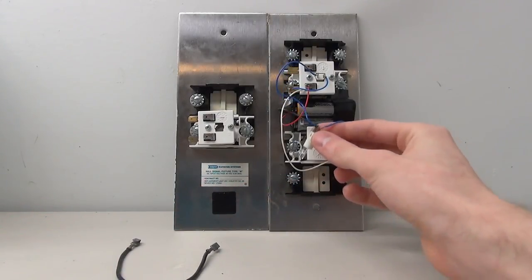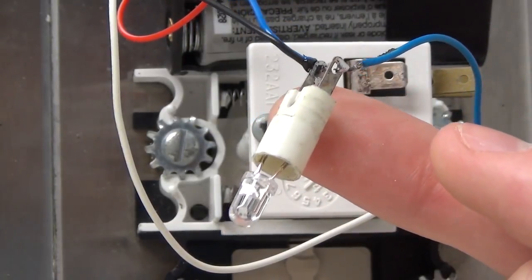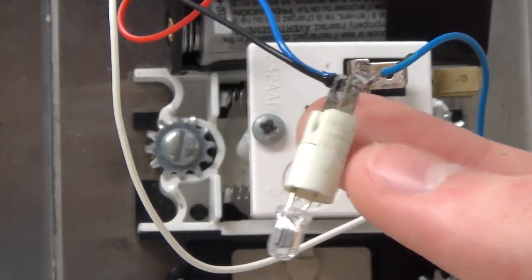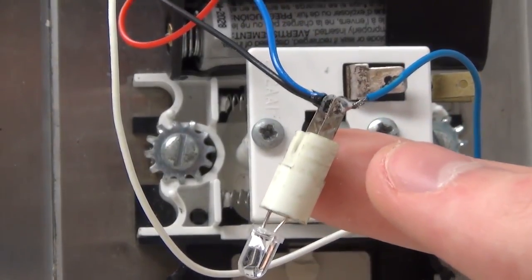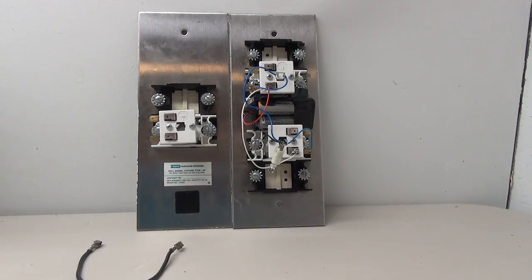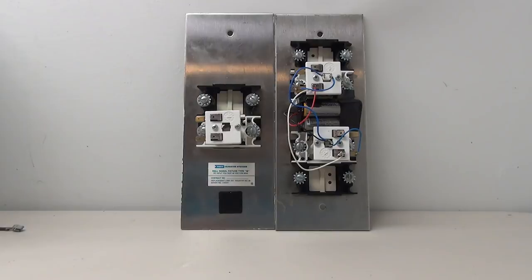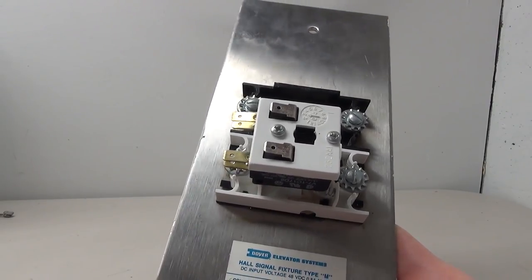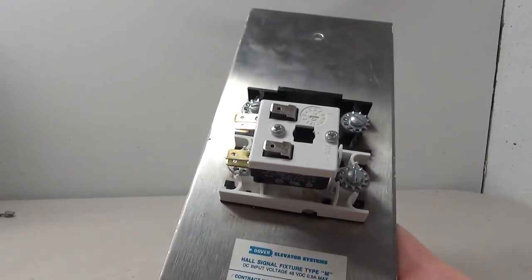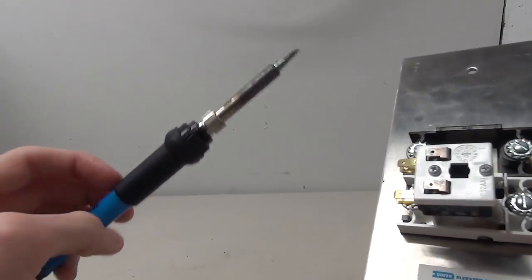Another thing your button may have is a lamp socket. Instead of an LED being inside, you'd normally have a little bulb — but we're not going to use the bulb for this project, we'll be using an LED. If you don't have a lamp socket we're going to have to get a little creative. In this project we're going to focus on what to do if you have none of the original Dover stuff — no wires, no lamp sockets, just some pins for a switch and a hole where a lamp socket would go. We'll have to find a way to mount the battery box and our LED. Soldering is going to be required if you don't have any of the connectors.